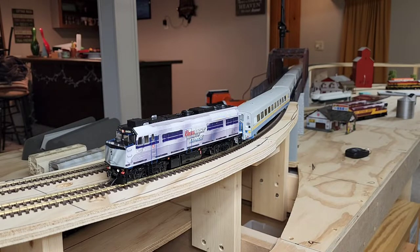Note that top and tail or push-pull operation can only be used with LRC or HEP2 passenger cars and certain HEP1 baggage cars, 8618 through 8623. Other VIA passenger cars do not have the necessary multiple unit cables to allow push-pull operation. When more than two locomotives are in consist, only the last two are providing HEP. The lead locomotives can be operated at idle.